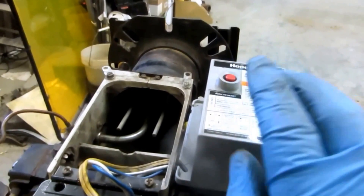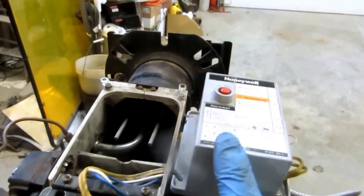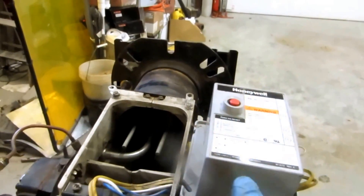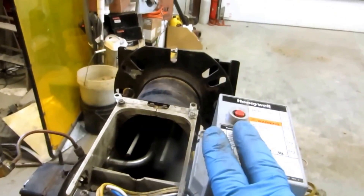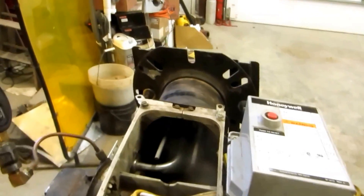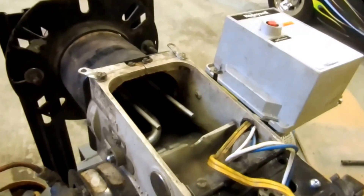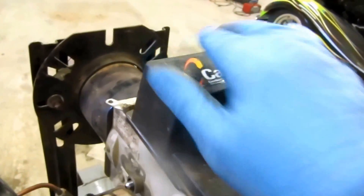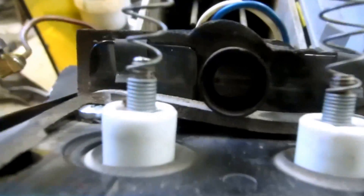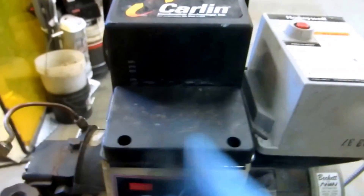That's why when you only hit the safety reset one time — because usually it's a 45-second safety protector relay — that means you're dumping 45 seconds worth of oil in there if it doesn't fire. You're just filling the chamber up with oil; you don't want that. So that's why we have safeties on these things. This one's a 15-second delay, so if it doesn't sense the light within 15 seconds, it's going to shut the safety off and shut the burner down.